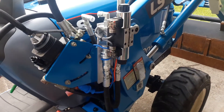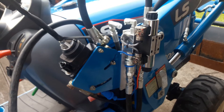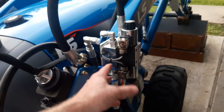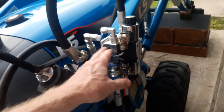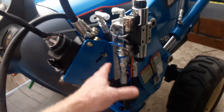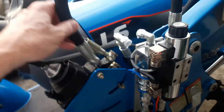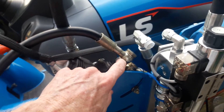Best of luck digging for all the parts you need. Some guys have said they just bought the valve blocks and solenoids and put theirs together themselves — that's probably just fine and wouldn't be much harder than going with the kit. But I like this Summit Hydraulics kit; I thought it had all the parts at a reasonable price. The biggest problem with this whole thing is understanding what your threads are coming out of your Power Beyond block.